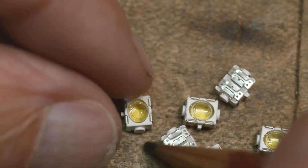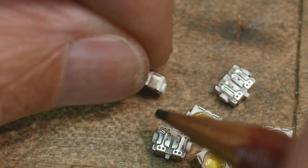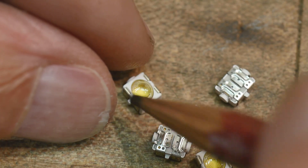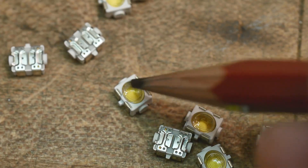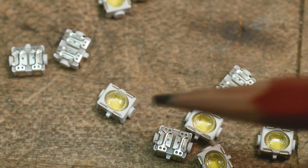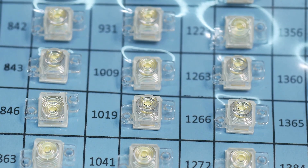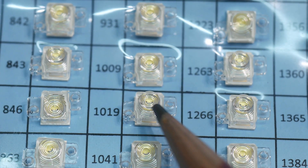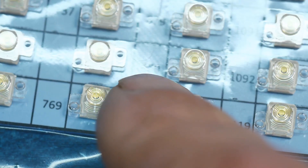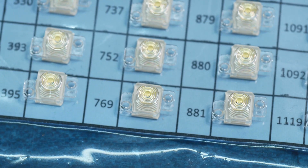Let me see if I can open one of these up. It's just an LED on a little lead frame and then a little lens - there's a little plastic piece around it and then the lens is glued in there. Let me get one out and take a look at that under the microscope. Since I've got this lens set up, let's look at the other ones marked as rejects. Under high magnification, it's very easy to see the Fresnel. You can see it's an oval shape - not a round shape. That's one of the tricks of trying to get a rectangle out in space.